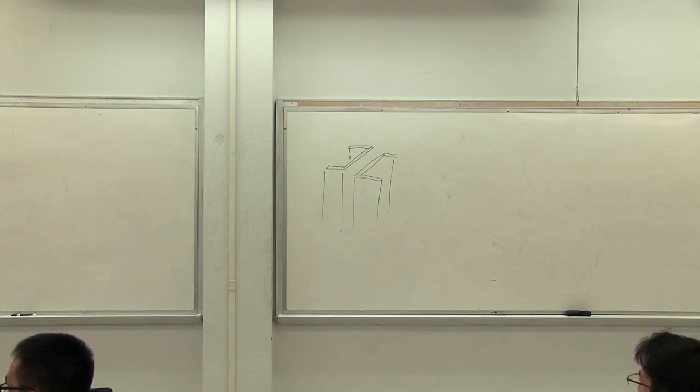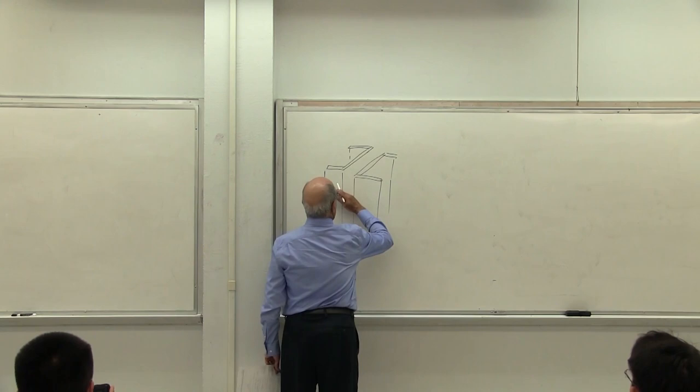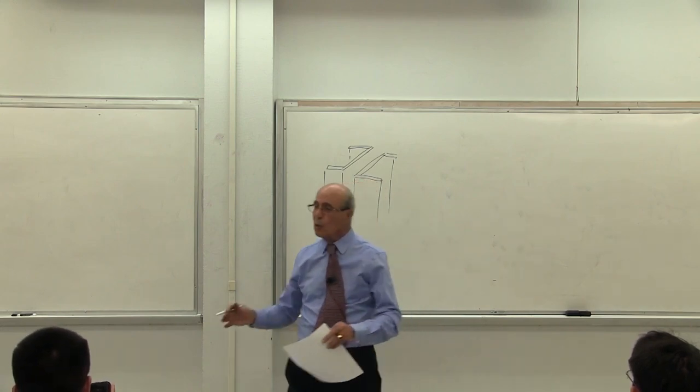Actually, if you look at problem number 17 at the top of that, you see the same one in my handout. Did you see that? The plate that they added was so that IX and IY become equal. This is a little bit different. Notice they put some part here, they call it lattice. That lattice only connects these two together, but does not add to your strength.